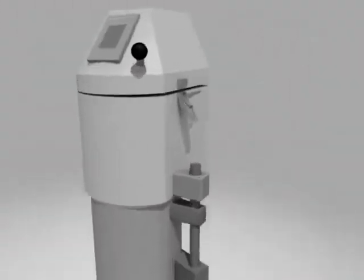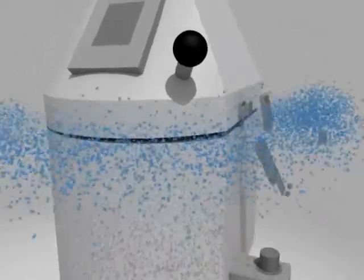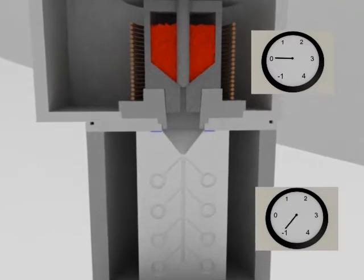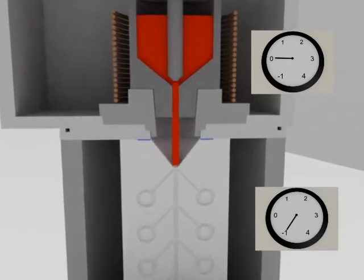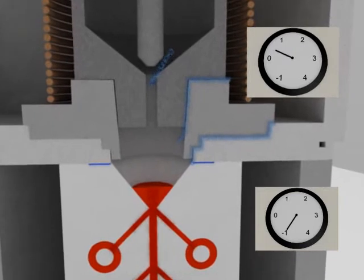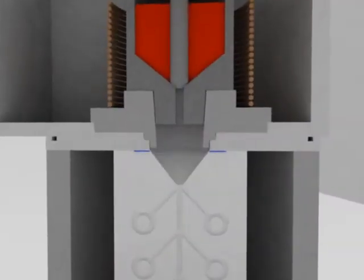In most of our competitors' machines, the metal cannot be effectively pressurized up to 4 bars, since the machine structure does not allow for this, and under this pressure the cover will blow out. During normal use at 1, maximum 2 bars, the applied gas pressure above the crucible can only act on the metal once the mould is occupied by jetting through the crucible feed hole to the underside. The effect of this pressure is drastically reduced by drag of the crucible holder, etc. In fact, application of gas overpressure by this method shows no significant advantage over a simple gravity vacuum system.